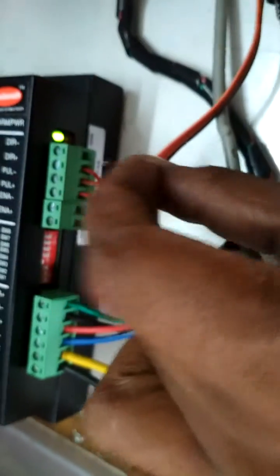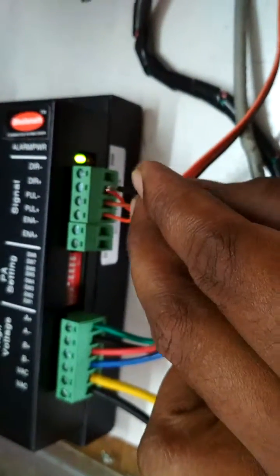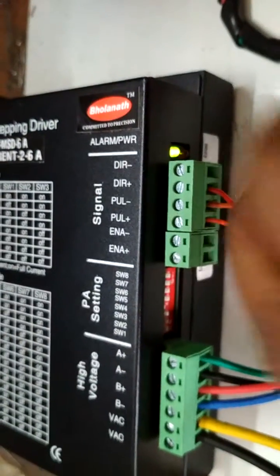Optionally I left the ground signal of the direction minus unconnected — you can see direction minus here. I have used a 400 Hz PWM frequency from the microcontroller and I will send it to the pulse pin.